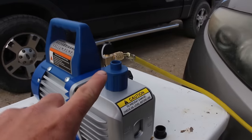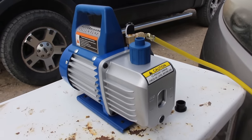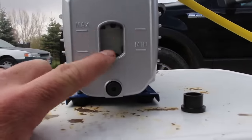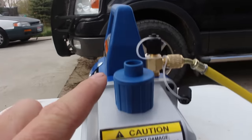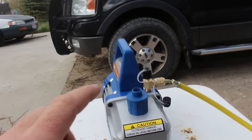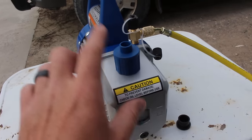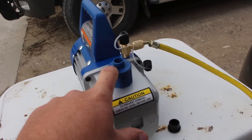You may notice a little bit of steam coming out of the exhaust port on your vacuum pump — this is completely normal. If you're worried, check your oil level; it should be between the max and the min. That steam is just condensation from the AC system or built up in the vacuum pump coming out of the exhaust port. It's not smoke, so don't be too worried.